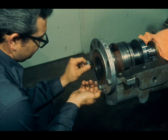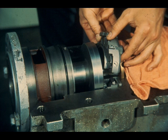The next step is to install the base rings on both sides of the thrust collar. One half of the inboard base ring was installed earlier along with its thrust shoes. Now the workman is installing the other half of the inboard ring, making sure the leveling plates on the two halves are properly interlocked. He then installs the base ring on the outboard side of the thrust collar, again making sure the leveling plates are interlocked.